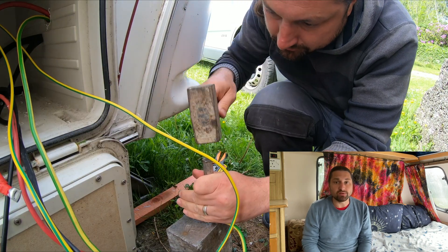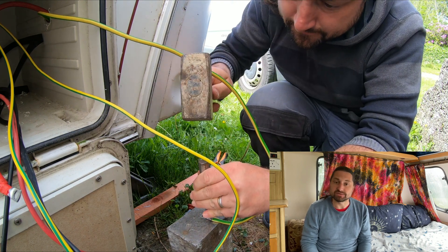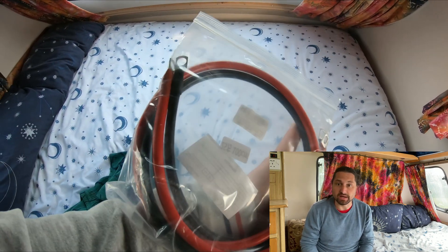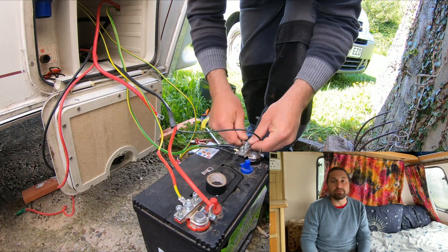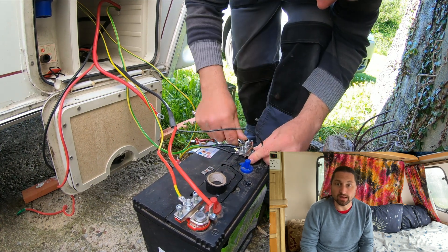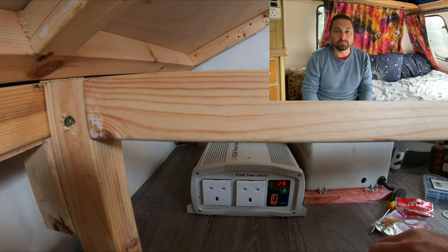The inverter should be connected using a minimum of 25mm square cabling but the provided length of negative cable was too short. So as a temporary measure to test the system I used 10mm square earth cable for the negative side. New cables for both the positive and negative sides have been ordered and will be fitted in due course. I am unlikely to exceed the cable rating as we are not planning to run any energy hungry appliances from our inverter, but safety first — the cables will be changed. There are plenty available on Amazon, eBay and other places. After making the connection to the battery I switched the unit on and plugged in a light-up fox and the unit was working.